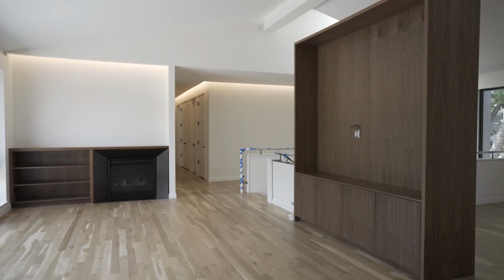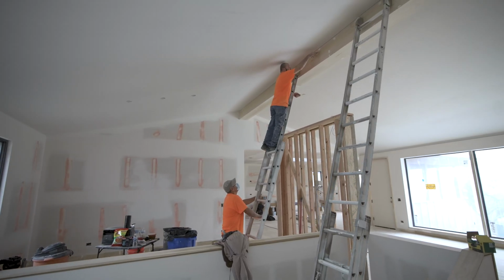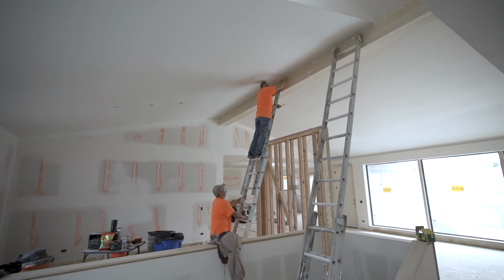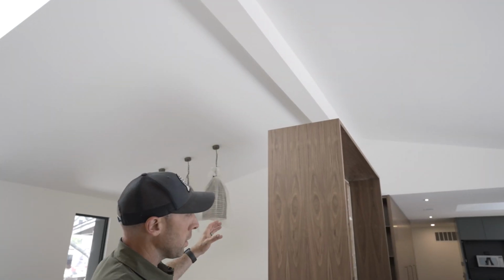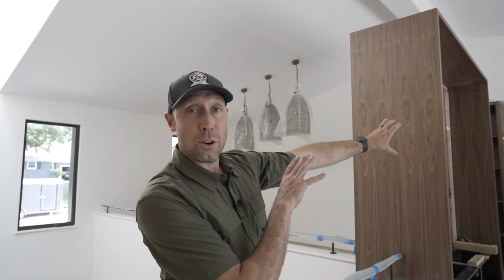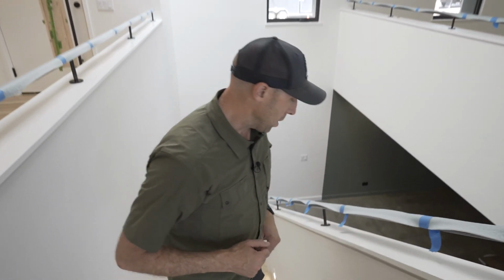Before we go down, just a quick note, this vaulted space here, this is our primary moisture concern in this house. This is where we use the Benjamin Moore vapor blocking paint. This is also that airspace that we're really concerned about drawing into that bulk return on the east end of the house, and why we chose to put a dedicated dehumidifier on the east end unit.